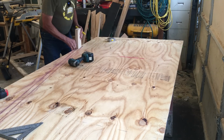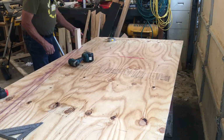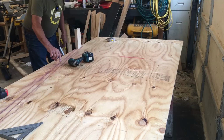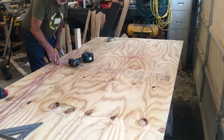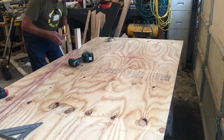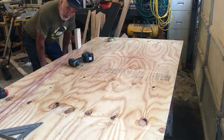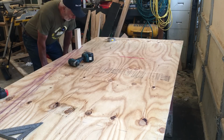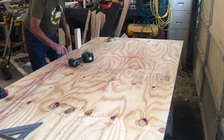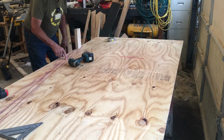So there's going to be a subfascia right here. The roof will come right down here onto a drip edge so that the water will shed out. I'm going to make the walls just out of a 2x4 ripped. I'm trying to keep, again, everything light. I don't want it heavy. It's going on a snowmobile trailer that will hold about 2,000 pounds, so my goal is to stay under that. So we're going to rip these at 1.5 inches out of an 8-foot 2x4.